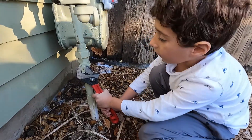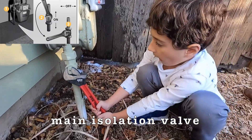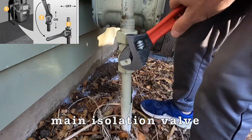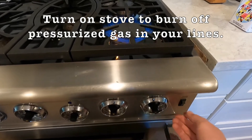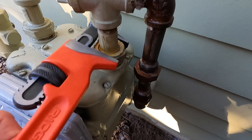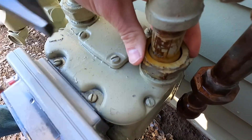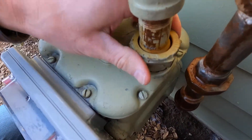So I've got this wrench on here. Now I'm gonna pull it — and it just comes up right easily. It's coming off the fitting real close, coming right out. The pipe is spinning with it. It was not in there tight at all. It doesn't even look like there's any thread sealant on it.